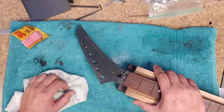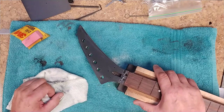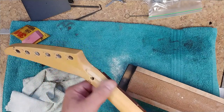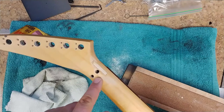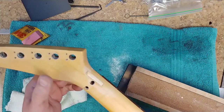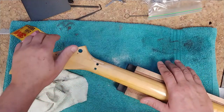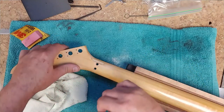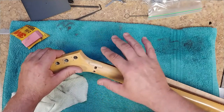I don't know if this thing has a story behind it or if it was a screw-up. It does look like a plywood body - I could see that in the neck pocket. I added a piece here to kind of fix that; a patch is never really pretty. I put some pressure on this to see if this crack would do anything and it really didn't. I hit it with CA glue, clamped the neck down, pushed on the headstock, and filled it with CA glue thinking it maybe opened up just a hair. I did the same thing on both sides at the same time.